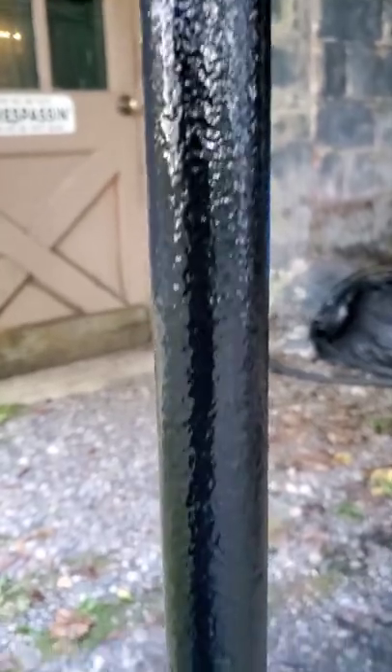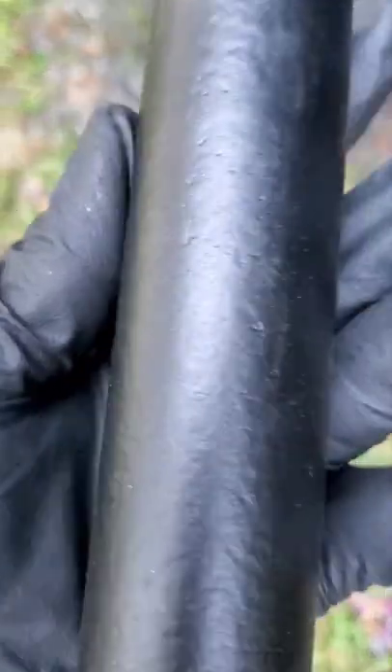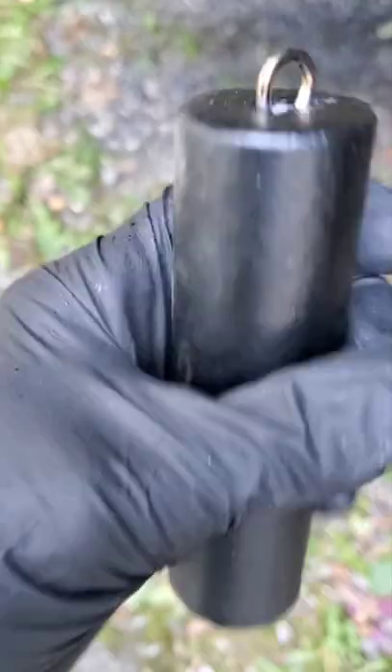You can see it's got a heavy texture right now, but that will all lay in as it dries, so don't worry about it too much. Just get a good coat on it and make sure you're not putting it on so thick that it'll run. Let it dry 24 hours and you'll be all set. Once done, it's going to look like this — you can see it lays in pretty smooth. Nothing wrong with that at all.